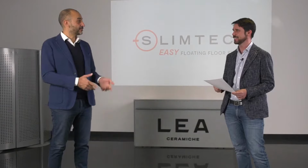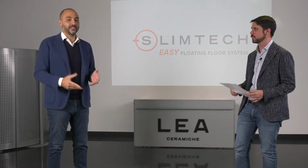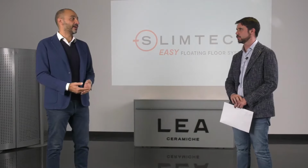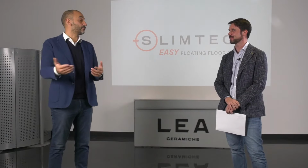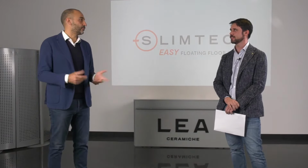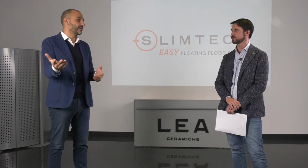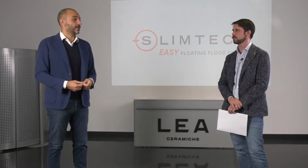And here is a final question. It's not very clear to me. Maybe you can grasp it. Is it possible to use the Slimtech Easy system on top of a raised floor? The question is correct. In case you want to renovate offices with a raised floor, for example, the 60 by 60 quite ugly floor, and you want to renovate the offices part. In this case, of course, with the system, it is more difficult to inspect everywhere, because with the 60 by 60, you can just lift it and you can see everywhere. With the system, you cover everything, so you should remove the slab for inspection. But it is possible.